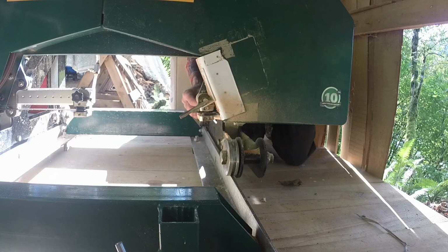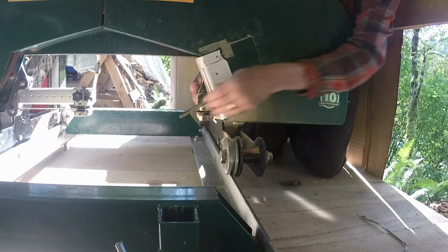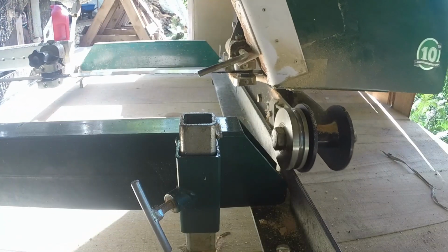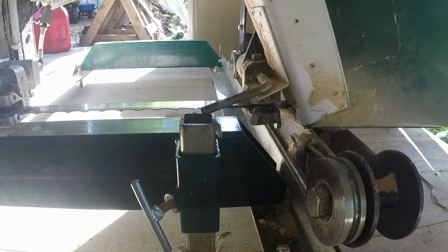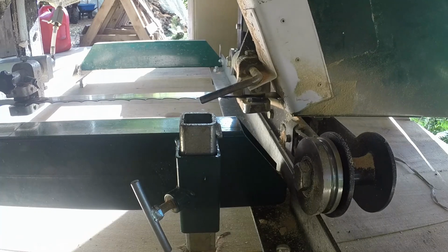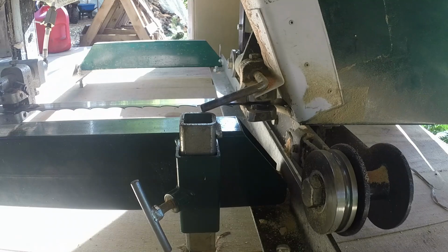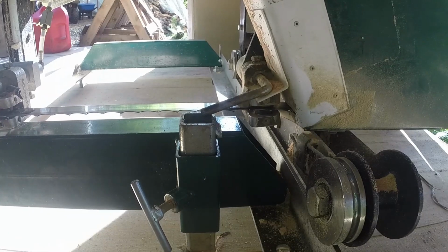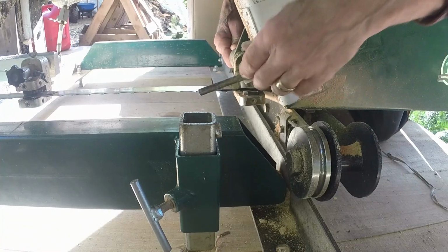My blade guard is tipped down a little too far and it hits log stops that the blade would otherwise clear. The blade guard is held in position by a small set screw which has to be accessed from behind the saw. Because the blade guard is round, it will ride over the log stop if pushed too hard at just the right height. I think I'm going to grind that off flat, put a flat face on it, so it'll either hit and stop or miss completely.